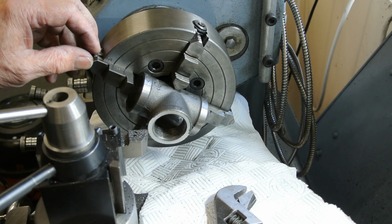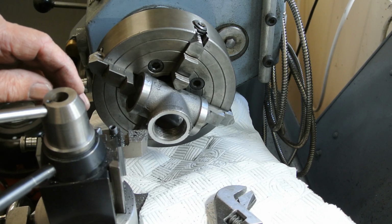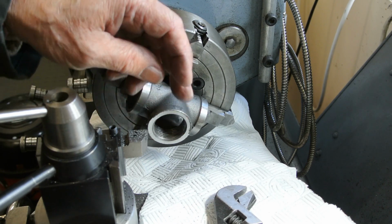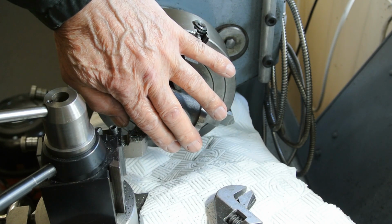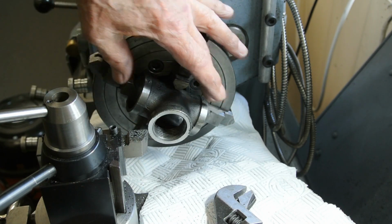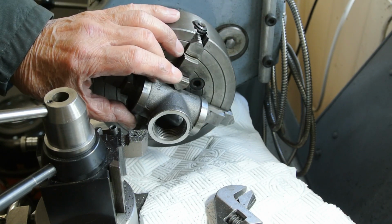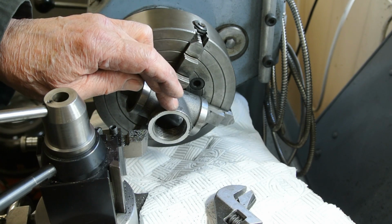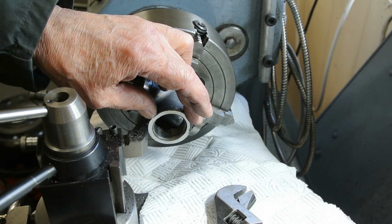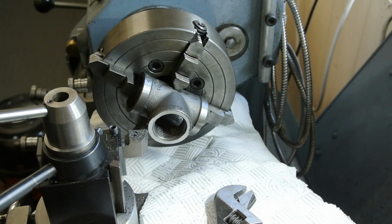So what I found was, if I take the tool out, turn the tool post round and back it up against here and keep pressure on that while I'm moving this in either direction, then it almost certainly will come out reasonably true. But I found that this piece here is not anywhere near as accurately aligned as these were. So I'm just going to find that,